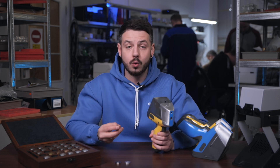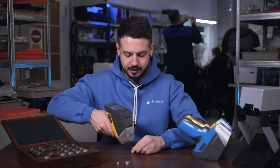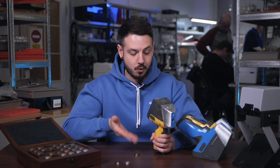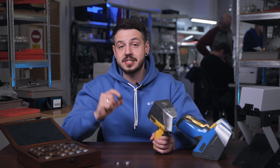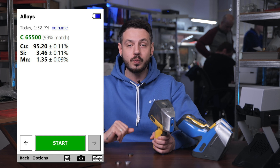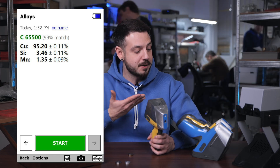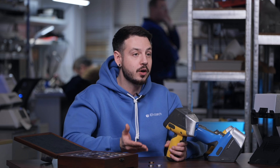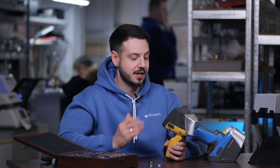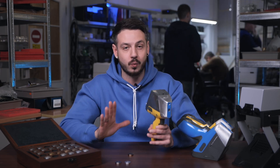Let's take one more sample with light elements — probably copper-based. After measurement with the Prospector 3 Max, we get the result: the sample contains 95.2% copper and 3.5% silicon. Silicon is a light element that would not be identified by the Prospector 3 base model. To determine the exact light element present, you need to use the Advanced or Max models. The basic model will only show that there is a 3.5% concentration of light elements, without naming the element.